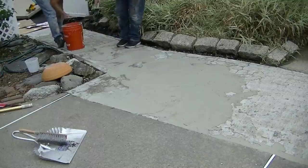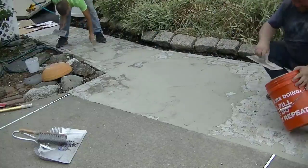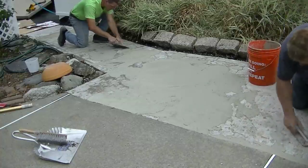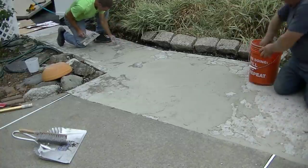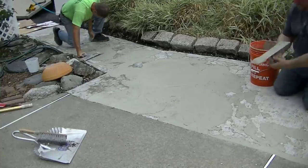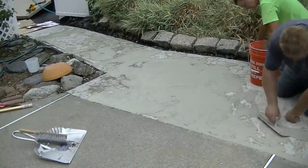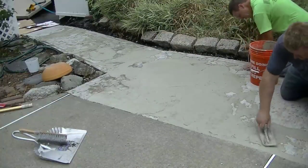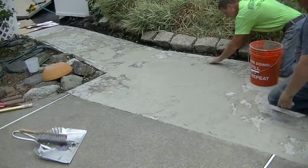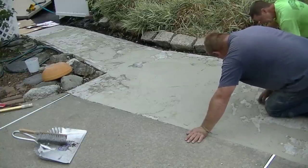Luke and I are going around making sure that 99% of the bad areas are fixed before we go over with the resurfacing material. The resurfacing material will fill in some of the really smaller areas, but it looks a lot better if you get all the bad areas filled in first. I'm even rubbing some of it into the small hairline cracks with my fingers just to get it really pushed down in there. This stuff is going to dry in about 30 minutes rock hard, so you'll be able to move right on to the next step.